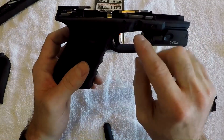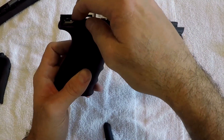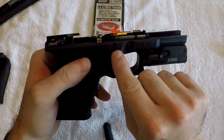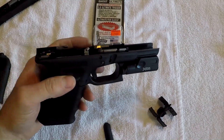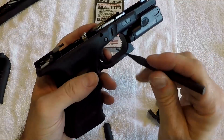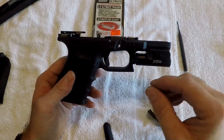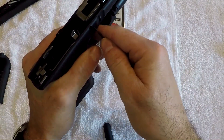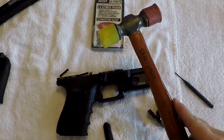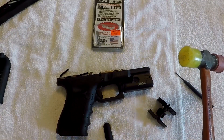There are three pins to worry about: two are easy and one is hard. The rear pin holds in the portion of the trigger where the factory disconnector sits, and that will have to come out. Then there's the small pin at the top, which can be a bit challenging at first but should go right to left fairly easily. The large trigger pin on this brand-new gun is extremely tight — I can't just punch it out with a pin punch. I'll need a little force with a nylon hammer. I'm going to take it off screen to knock this pin out and bring it right back.